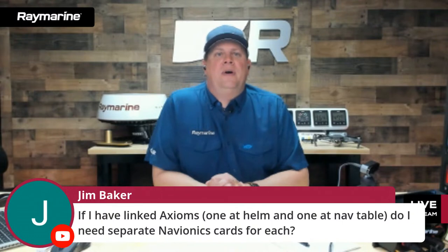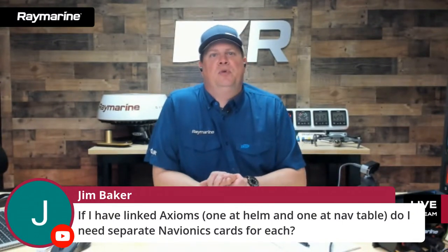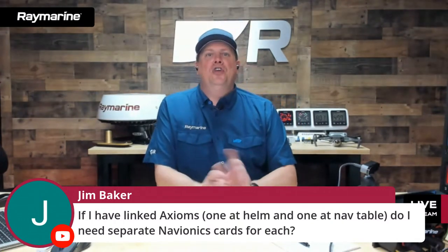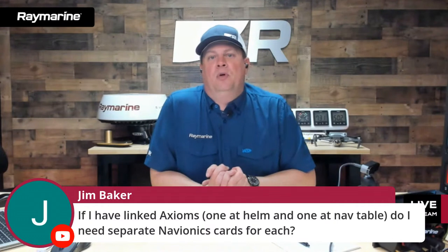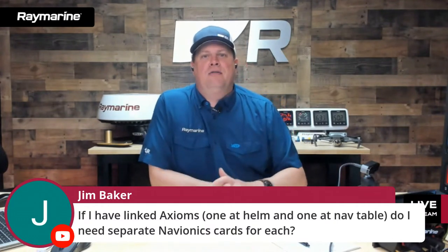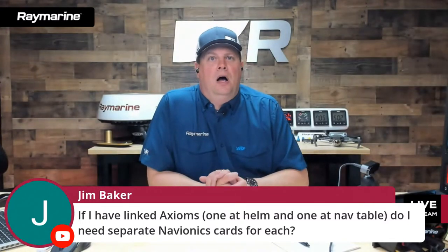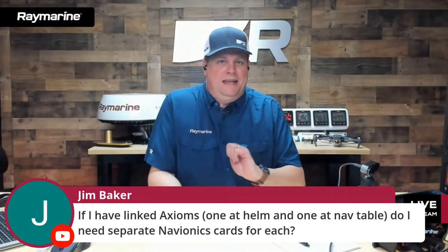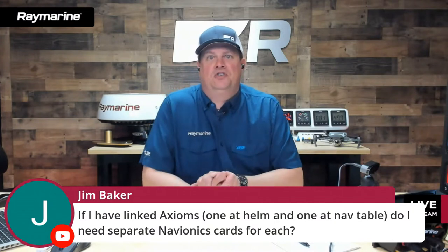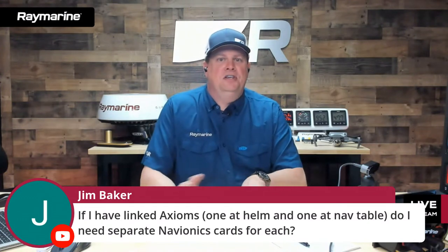Jim would like to know, if I have linked Axioms, one at the helm, one at the nav table, do I need separate Navionics cards for each? The answer to that, Jim, is no. As long as you run a network cable between your two Axioms, they will share cartography across the RayNet Ethernet connection. So the card can be plugged in at either Axiom, but it is visible on both as long as they're both switched on. You can also have different cards in different Axioms.